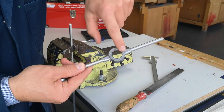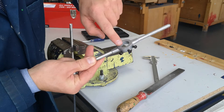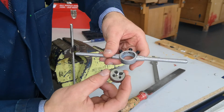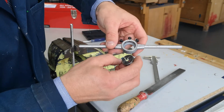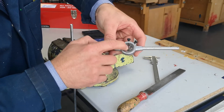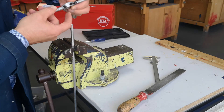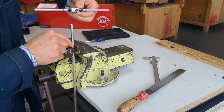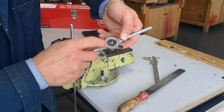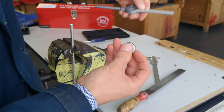On the die stock, that coupling — the little ledge — should be facing upwards. When you put the die in, check which side is the tapered side, so that when you position the stock over the aluminium bar the tapered side is facing toward the end of the bar and that ledge on top is facing upwards.